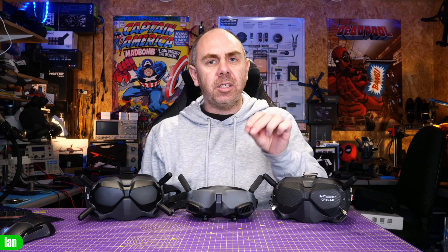Right now they can't because these goggles do not support dual band. The original FPV system only worked on 5 gigahertz — the remote, telemetry, and video were all on the same frequency. O3, on the other hand, whilst it transmits video on 5 gigahertz, it can use both 5 GHz and 2.4 GHz for the RC link and telemetry, and as a result these goggles are not compatible.